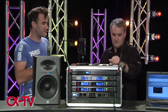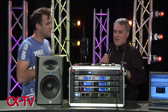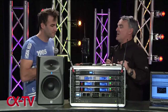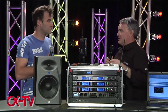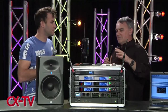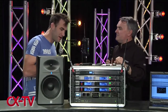No matter how good the RF tech is, they can't predict when an ENG crew comes in and flips on their own wireless gear. The trick is to pre-calculate 60 frequencies if you need 40 mics working — spare frequencies for somewhere to go or for new people who turn up unannounced. That works fine for a one-off show with a dedicated frequency manager, but for a long-running musical theatre production going on the road for six months it gets very expensive. So the desire has been to build that level of intelligence and self-management into the hardware — effectively plug-and-play.